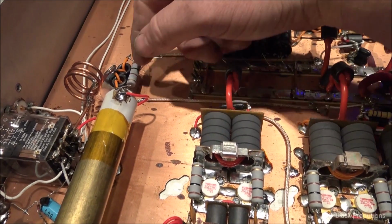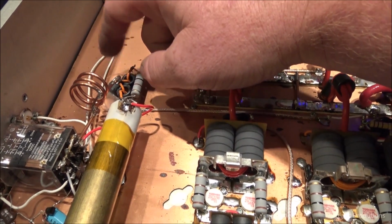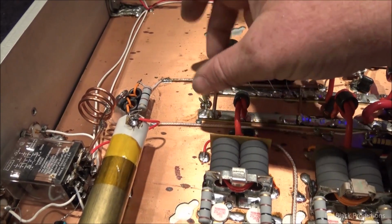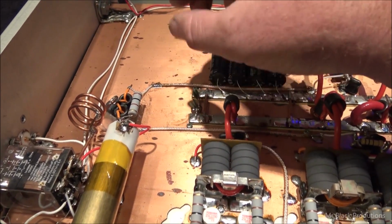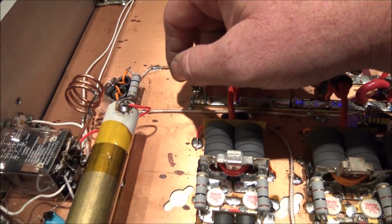It's a commercial grade hot glue that I use to hold these down. And you've got to use hot glue because epoxy's too brittle, and because this is in between the two heat sinks and this board has a tendency to flex either in shipping or riding around in the mobile, that will break off if you epoxy that down.